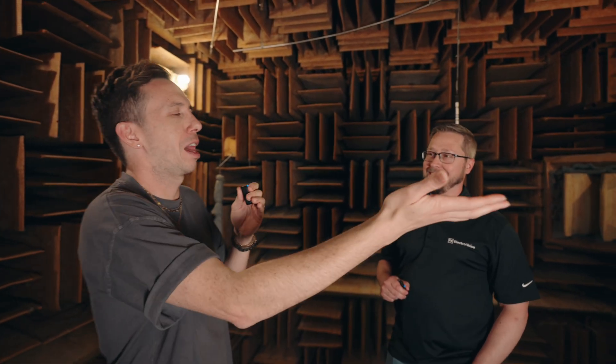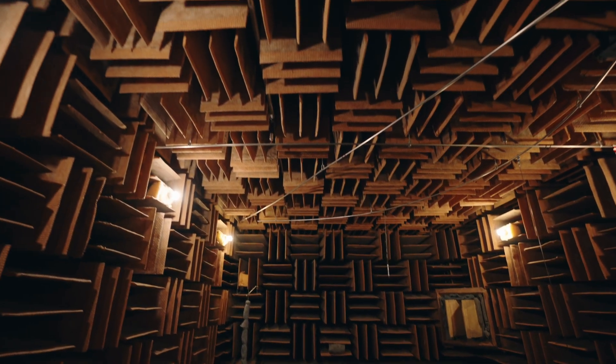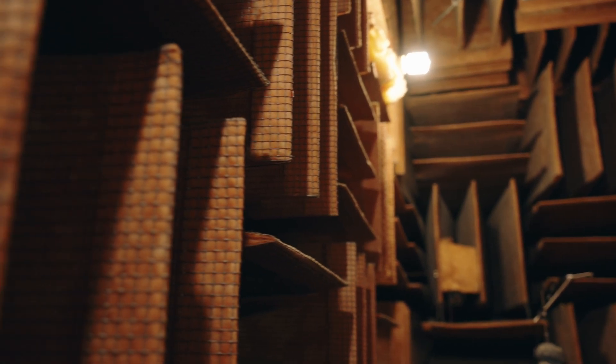You're not just putting random wedges in places. The wedges are shaped the way they are — anechoic chambers were designed a very long time ago and there are a couple of companies that produce them. The wedge shape is designed so that any audio wave that hits it spreads out or diffracts and then gets absorbed by the rest of the wedge. You're creating a lot of surface area by making it a wedge, and it gradually attenuates the sound as opposed to having a large flat surface. If it was just a big solid piece of fiberglass, at some frequency you'd get a bounce off of it.